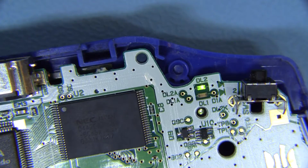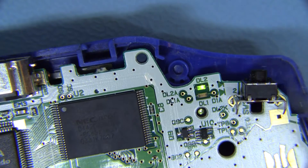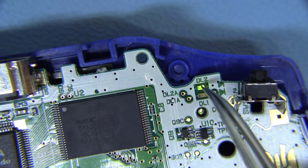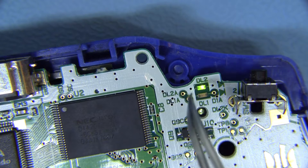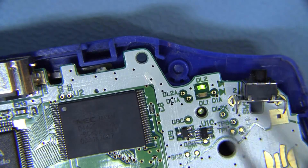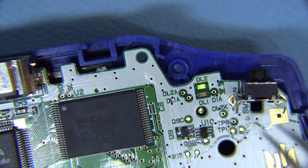Hello Reddit. I don't have time to do this properly but we'll at least try to get this LED swap done on the GBA. There are two LEDs — the power LED and the low battery LED. You want to swap this one. They've nicely marked which way is positive and negative. This side is positive, this side is negative. I don't have another LED to swap in, so maybe I'll try to swap this one off and then back on. There's not much of any pad to work with.